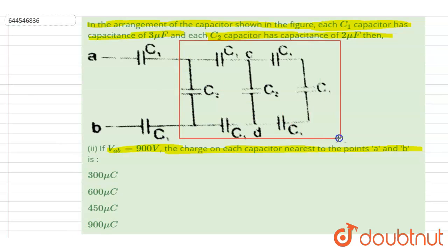Let's say the capacitance of this part is C dash. We want the charges on the two capacitors. From symmetry, the charges on the two will be the same. C dash, C1, and C1 are in series, and in a series combination the charge on each capacitor is the same. So here the charge will be Q, here the charge will be Q, and C dash will also have the same charge Q since the three are in series.